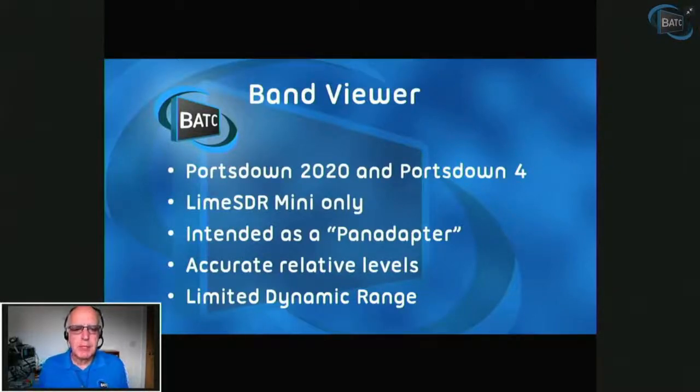The display is calibrated in dB. Those relative levels are mathematically calculated and, as long as the ADC in the Lime SDR is correct — which it is — they are accurate within fractions of a dB. However, absolute levels vary with frequency and individual Lime SDR model, so use it as a relative level indicator only. The other limitation is relatively limited dynamic range compared with a regular spectrum analyzer: a normal analyzer might give 80 dB dynamic range; this is probably 60 to 65 dB maximum, but that's fine for receiving.